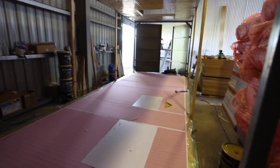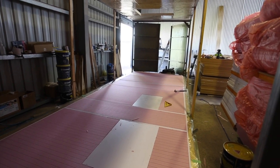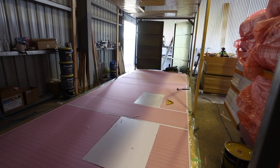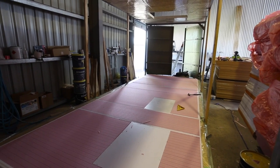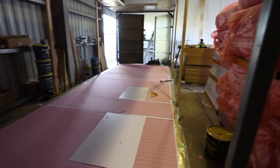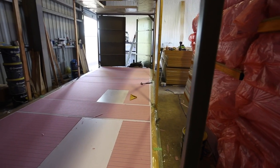PVC is not nearly as rigid as timber, and it doesn't take a screw fantastically well. So I'm going to be gluing those back onto the foam and using some 60mm screws to sort of hold it in place.